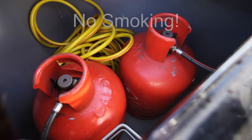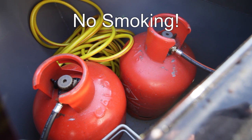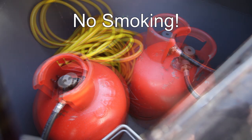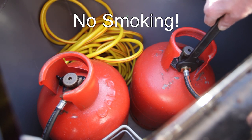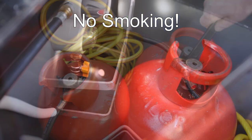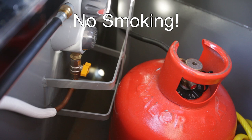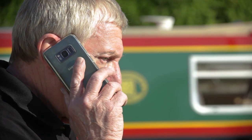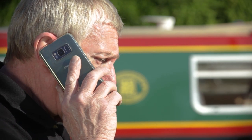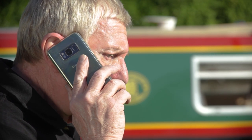Right at the bow is the gas locker, which has two or more gas cylinders. These are connected to a regulator which will automatically switch from one to the other as gas is used up. If you need to change to a third cylinder, shut off all the gas by closing the valves and connect the hose using the spanner provided — it's a left-handed thread, so it's clockwise to remove. There's also an emergency cut-off valve, which should be used if you suspect a leak or can smell gas. If this happens, don't switch anything electrical on or off. Get everyone off the boat and contact the boatyard using a phone from outside the boat — mobile phones can create a spark.